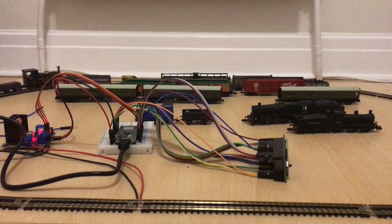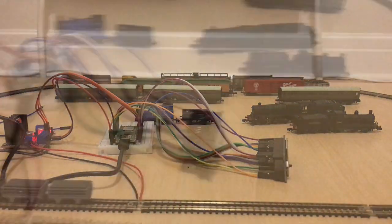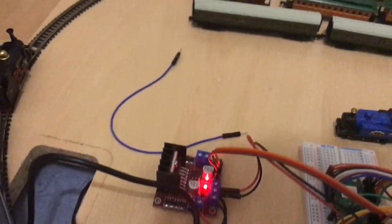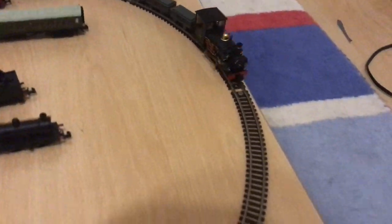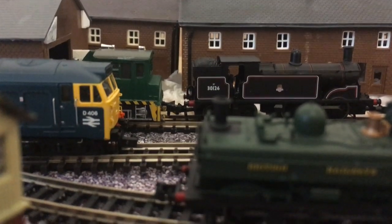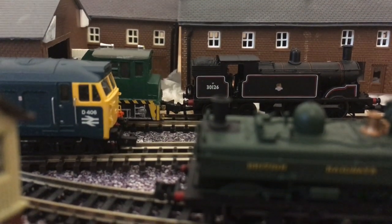To prove all the locos work on it, here's Charles - due to the gearing and voltage it's running very fast, but this is now a ninth loco running and that works as well. It works out much cheaper than a standard controller - in theory all you need is a 12 volt power supply, a Raspberry Pi Pico, and a motor controller. I'm interested to see what people think. Thank you for watching - please like and subscribe and leave a comment with video ideas or feedback. Goodbye!